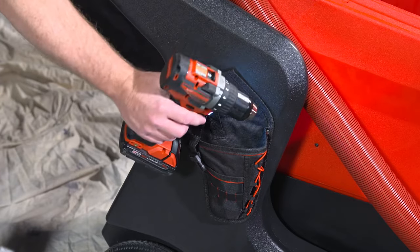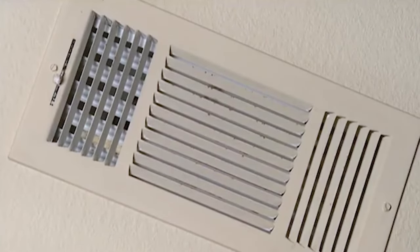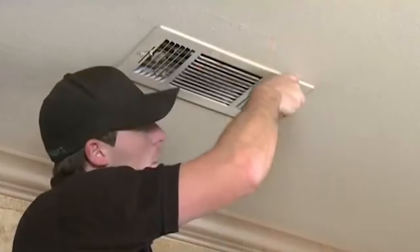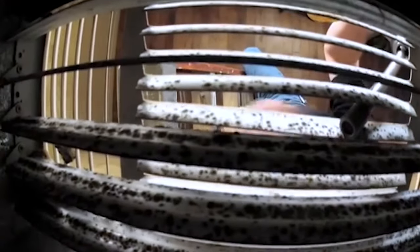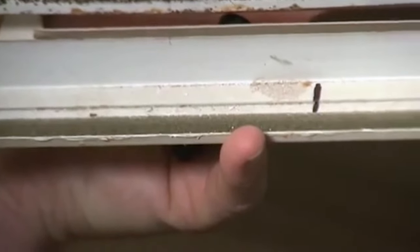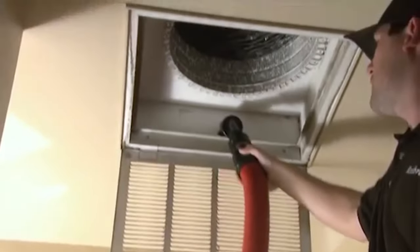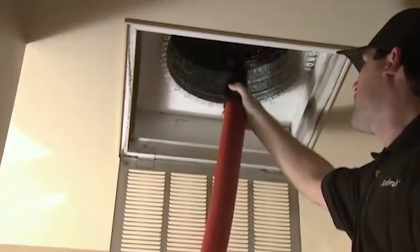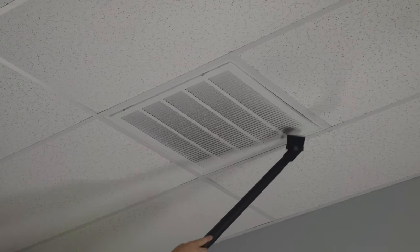A battery-powered screwdriver is generally the best tool for removing a register. You may find a register that is painted or caulked — use your knife and cut away from the corners. If you go all the way off one edge, you risk marking the entire wall. After removing the registers, clean the register and the boot opening. If there are heavy contaminants, mark the register so you know where it goes when you return. If registers are not heavily soiled, use your nozzle adapter and dust brush to vacuum, or use a HEPA-filtered shop vac. Also vacuum out the boot area. If register covers need more aggressive cleaning, remove them and take outside.